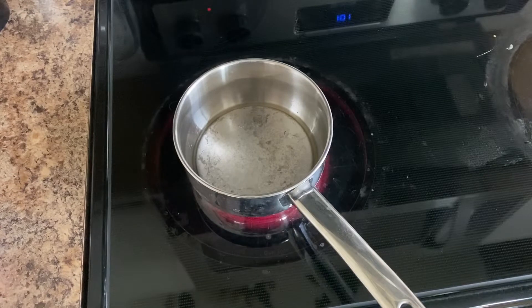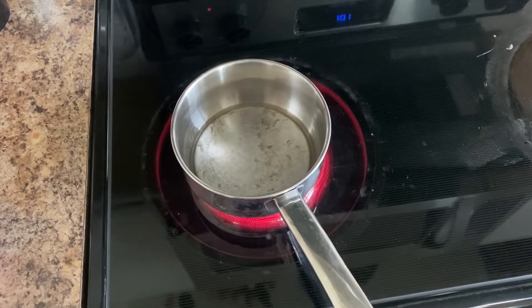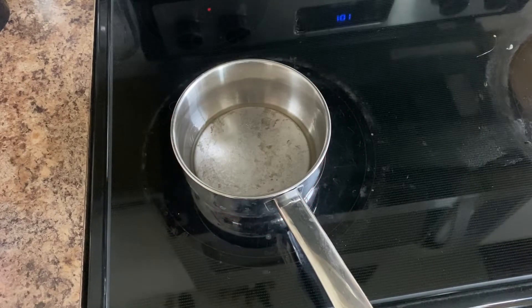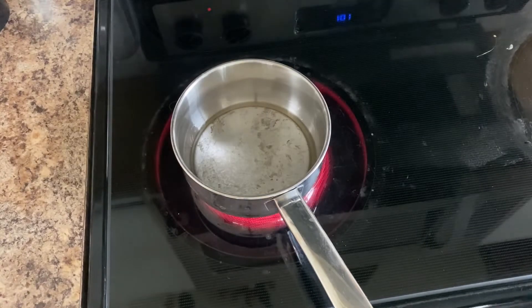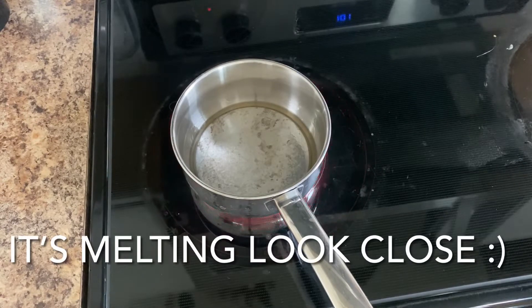This alloy melts at a very low temperature, and I have the video sped up here. This alloy melts at about 200 degrees Celsius, about 380-390 degrees Fahrenheit, give or take. It's pretty low temperature — far below the smoke temperature of the peanut oil that I'm using. I use the peanut oil kind of as a flux and to prevent oxidation.